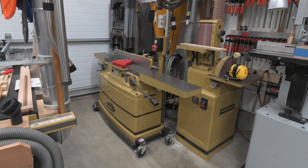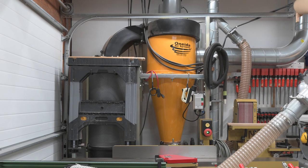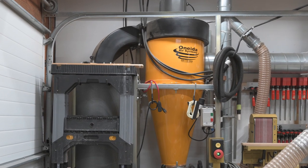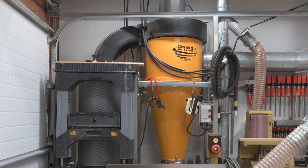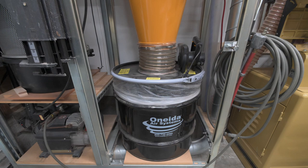In the front left corner is my Powermatic 8-inch jointer. Positioned here this close to the garage door, I do have to open the door when jointing boards longer than 42 inches, but I have no clearance issues on the infeed side from either the belt sander or bandsaw. Behind the jointer is the dust collector — it's an Oneida 3-horsepower model connected to most of the stationary machines by way of metal spiral pipe, manually operated blast gates, and flex hose. The collector sits above a 35-gallon steel drum which I normally empty about every other month unless I'm using the thickness planer and jointer more frequently.